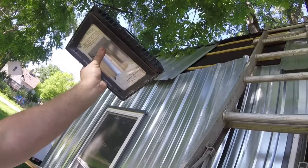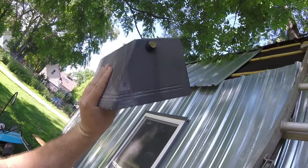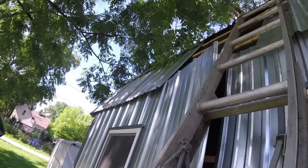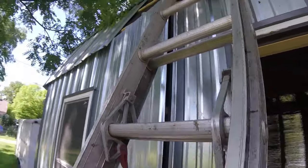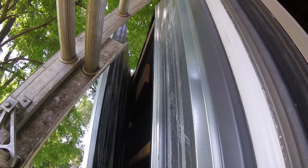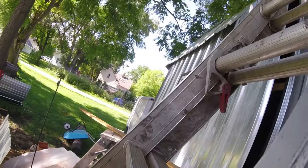I think I've said pretty much everything on my mind right now. I need to point out this light here and I needed to figure out how to mount this thing because it's a pretty heavy light. I got it at a university surplus store — it's an outside utility light. Since my paneling design has about an inch gap between the paneling and the outer OSB wall, I need to fill that in. I actually screwed in a one-inch square piece of wood there, and that's where I'll mount this so it has enough rigidity.